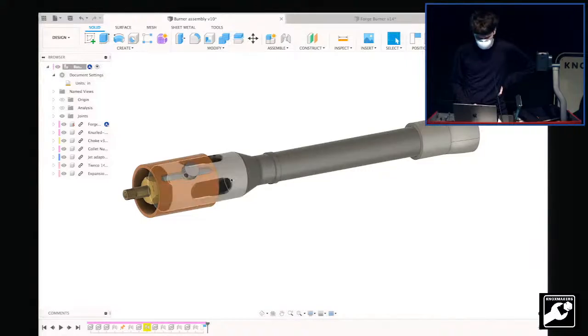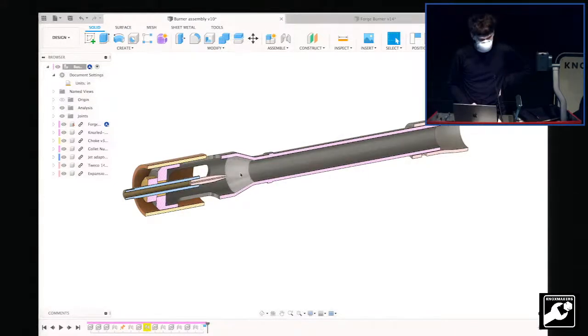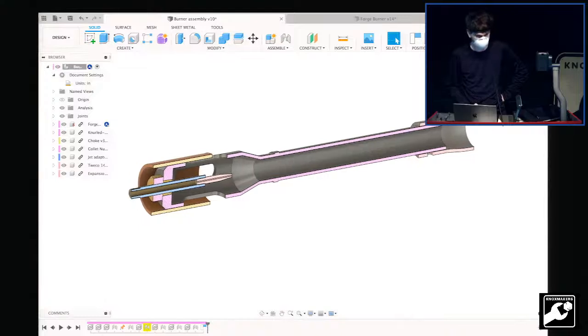Now, what happens is this is a Venturi burner, so it's air-fed just passively. The air comes in and accelerates as it goes through this throat, and the jet speed when it gets constricted in like that is above the flame speed in the propane, so burning can't happen. Then it hits this little lip and goes through a 1/12 expansion, which is actually a bit longer, that's the ideal expansion rate. Then the jet speed slows down below the flame speed, so all of your burning happens right there.